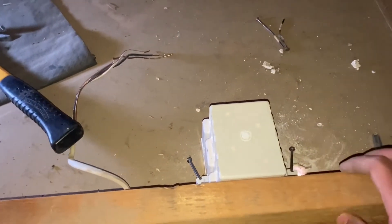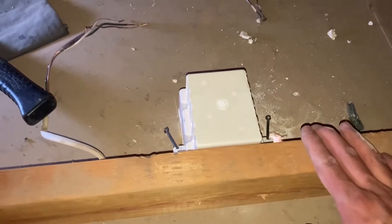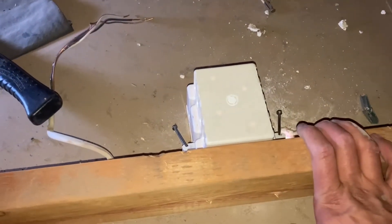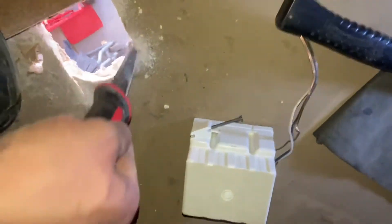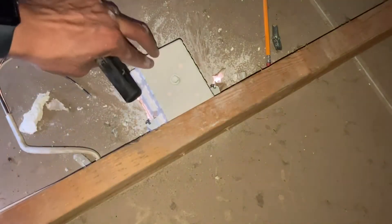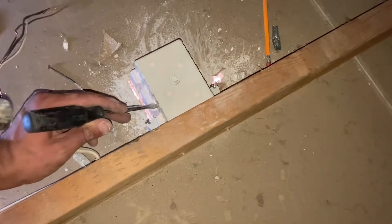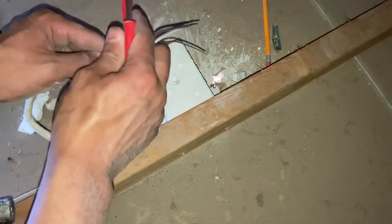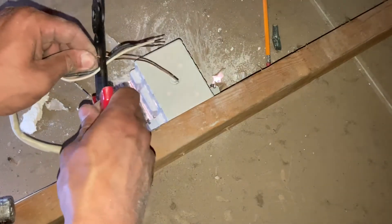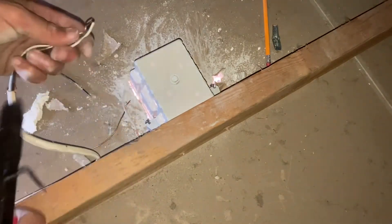I use a two-gang even though I'm only using one outlet, just to make up for the extra space of this size of hole. I'm going to trace this and then use my drywall saw to cut that out and nail these into the stud. If you don't have access to the attic like this, you'll just use what's called an old-work outlet case — they just have these little things that clamp on. Then I'll take a flathead screwdriver and hammer and knock out a little slot for the new wire, and trim all these wires down since they were so long for the old fixture.